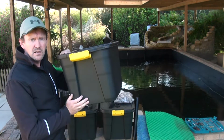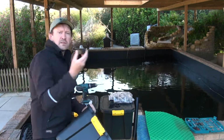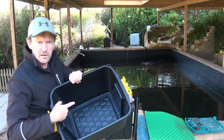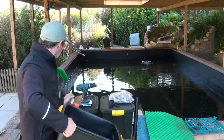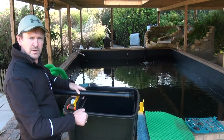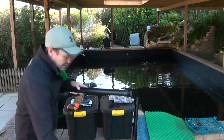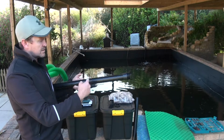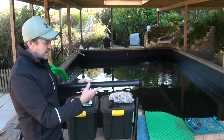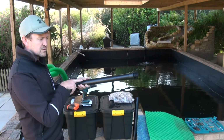The plan is, the top one, I'm going to bore a hole into the side using my cutter, drill that in, and then insert. I've got 1.5-inch pipe, so I'm going to cut a length of this off so it's long enough to go over the top, like so. I've got a stop end that I've fitted to the end of this one, and then when that's cut off there, I'm going to drill lots and lots of holes all the way along to make it like a shower, and then I'll attach a hose connector to the end for my pump,